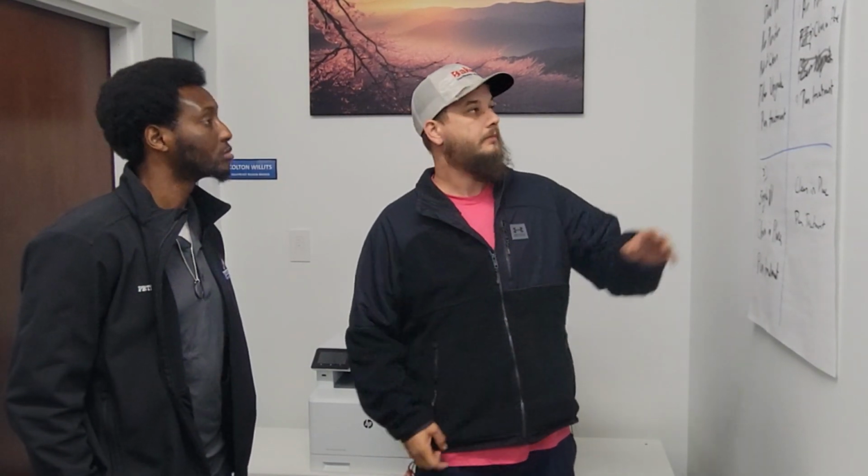Mr. Peters. So I did the maintenance today and we found a few things that I'd like to go over with you. Here's some pictures of the evaporator coil. As you notice, the fin stack on here, you're at about an 80% clog. So we need to do something or it's going to really harm your blower and stress your compressor out. It's also lowering dramatically the quality of the air in your home. It's a risk for both you and your system.